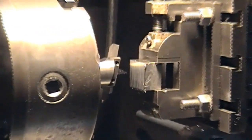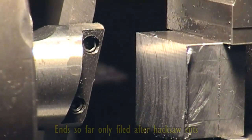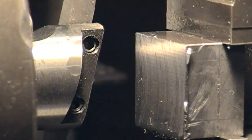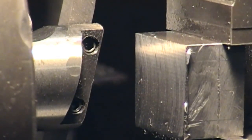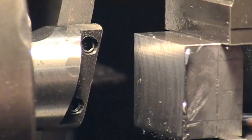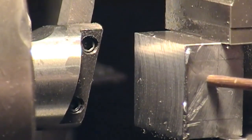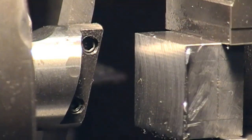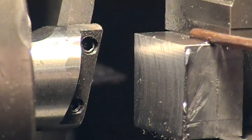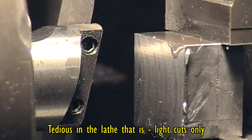We're going a bit tighter. Here we are — it's not too bad. The finish isn't critical, actually feels quite good. The fly cutter does the job. You might be able to see the scribe lines — there's a vertical scribe line there and two other lines, which represent the form. We've actually got to remove material at top and bottom just to get the width relief across here. Nothing very complicated, just tedious, and then we'll drill and tap it.